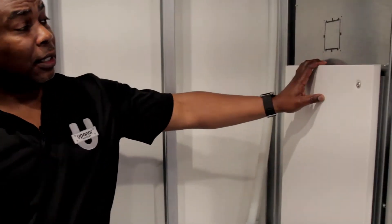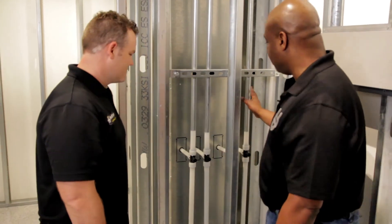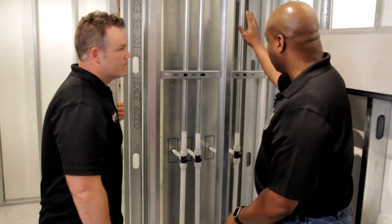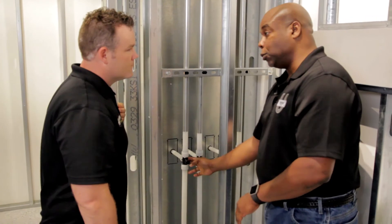The funny part about it is that most people see this whole thing and say every time I see in-suite, it means plumbing. Well, it's not just for plumbing anymore. Take, for example, this air handler. This vertical air handler has two coils in it. It's a four-pipe system — two-pipe supply and return for chill, two-pipe supply and return for the hot water. So now we're on the back of the air handler. You have two-pipe chilled supply and return water, and also hot water supply and return, and this amazing opposing port tee.